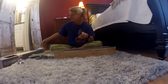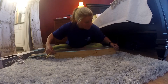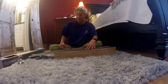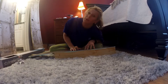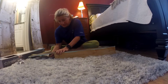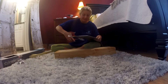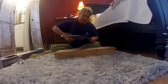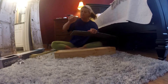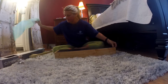They are tin snips — straight, not angled — so I can cut it straight. I marked the tile on top; there's going to be a little line about a quarter of an inch, but on mine, unless you lean way up underneath it, you can't really tell there's a small gap there. It doesn't bother me. I just take the tile and mark where I need to cut it, then use the snips to cut. It's not perfect, but if you want perfect, use a utility knife and a straight edge and snap it.